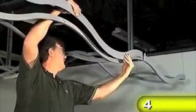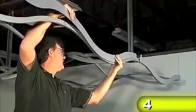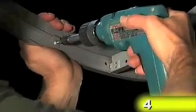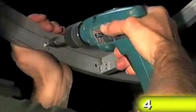Do not butt together adjoining lengths of edge trim. Instead, leave an 1/8 of an inch gap between trim pieces. At corners, leave a 3/8 inch gap between the leading edge of the trim and the end of the tee. These gaps will be concealed by the edge trim splice covers and corner covers. To install these, bend the upper portion over the top of the edge trim. Use the number 6 or number 7 3/8 inch sheet metal screws provided to secure the trim bracket to the tee.